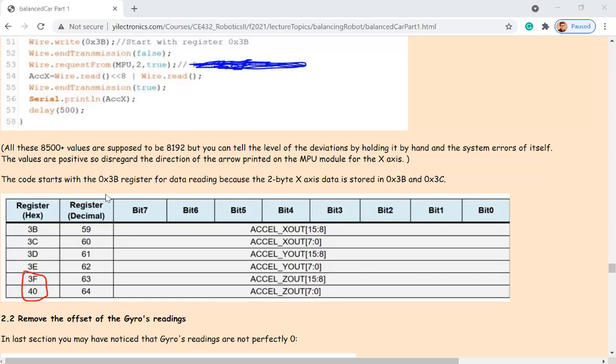So I have that new data, and the other half is all zeros. If I OR them bit by bit, then I'm going to plug all the data in here. Same for this part, okay? So that's how it combines the two 8 bits to make 16-bit data for the x-axis acceleration. Same concept for Y and Z. Is that how I can get the acceleration data?